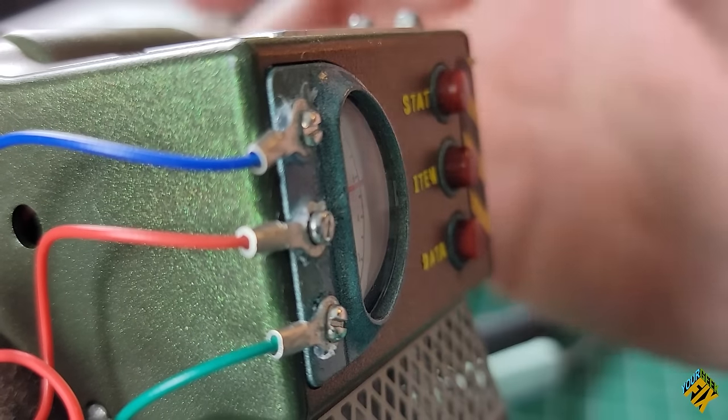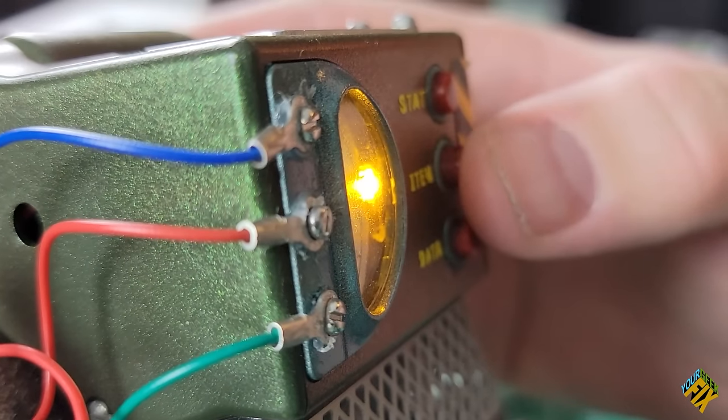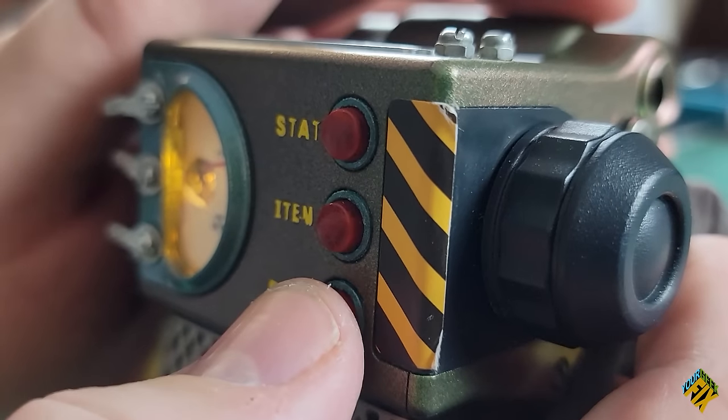The top button was connected to one soft white light and from there to the connector. The second button was connected to two flashers in circuit and from there to the meter — because the two flashers act as variable resistors, limiting power in different amounts at different times, making the needle look more organic in its movement. The bottom button is for sound. He contacted Evan Designs to make a small speaker with a chip attached that produces a Geiger counter sound — small enough to fit perfectly in the remaining space. Now, as long as the connector cable completes the circuit, there are lights, the Geiger counter needle bouncing, and sound.